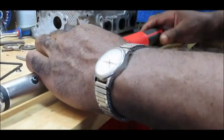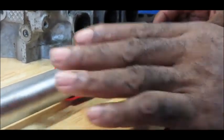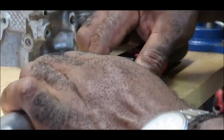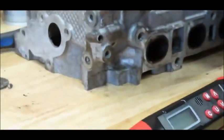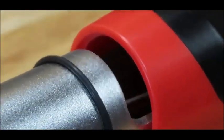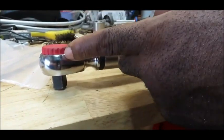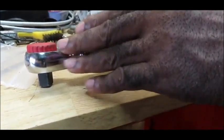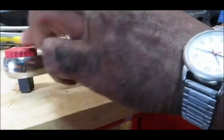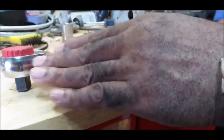Turn this wrench over to the other side. I took out two Allen key screws here just to show you something — don't take that apart on your ratchet. If I back this handle up, you can see a set of wires inside there. I'm showing you this because here is the precaution: do not use the head of this ratchet for a hammer, don't drop it, don't stick it in water — or you will damage this mechanism up here, which is actually what torques it. You've got to be very careful with the head of this ratchet.